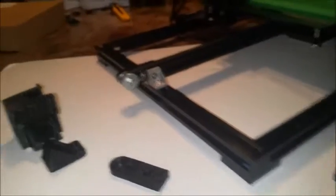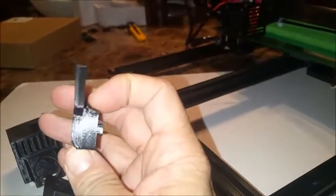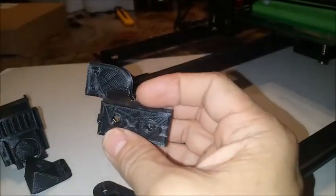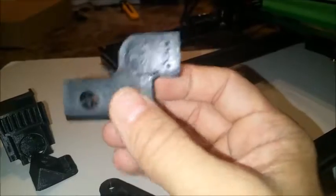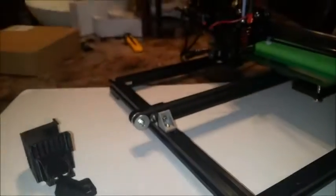Then I have this one other component. You'll see this right here. It's offset, and it's got the raised edges in the back to fit inside the extrusion. These holes are recessed so we can get our screws in there nice and deep. And here we can mount our X-axis end stop. Let me show you the idea behind this and how I'm going to mount it.